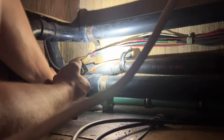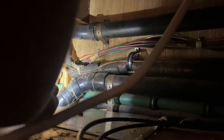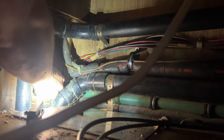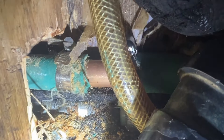We're cutting with a razor knife here — cutting that line. We can't get to the part behind the bathroom wall, so we're cutting it and going to slide a three-quarter inch copper pipe through the hose, then put hose clamps on it. It's going through the section beyond where the chewing was, and the pipe with hose clamps will seal it. We're going to leak test it — hopefully good for quite a while. We definitely need to get something in here to take care of the rodents so we don't have any more rodent damage.